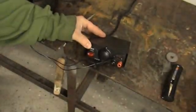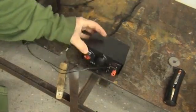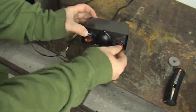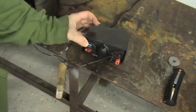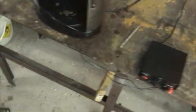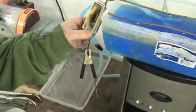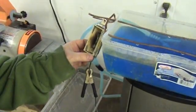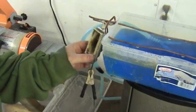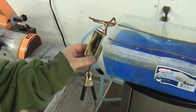I'm using a 3-amp power source from Radio Shack — it just plugs into a regular AC outlet and gives you nice little turn-style knobs to put your wires into. I also have inline a 1.5-amp car dome light, and that's just to reduce the amperage from 3 amps down to 1.5 amps.